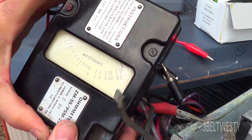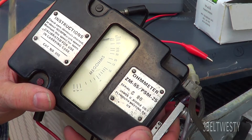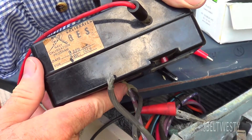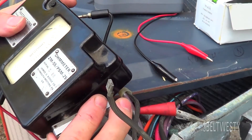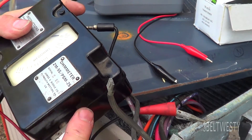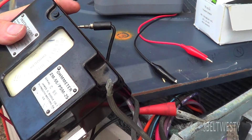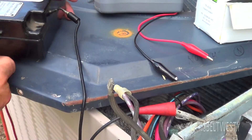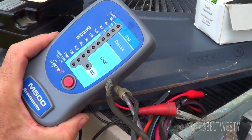This is a Biddle Z-M55, last calibrated in 1968 — it's a Navy cal. This is actually a hand crank generator that puts out 500 volts when you turn it at about 180 RPM, which is 3 revs a second. It's got a scale that swings. Sometimes having two of these devices is good because it gives you a ballpark — good, bad, caution — it's excellent for that.